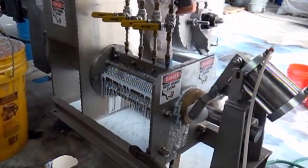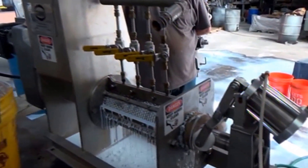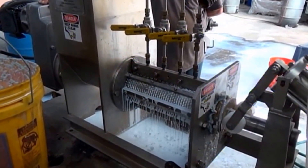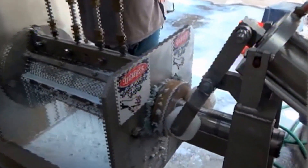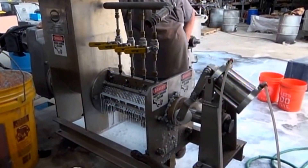After that false start, we're letting it run to empty out the inlet hopper, hoping to pack enough material in here to form a plug and get this started. That's more like it — I was afraid it was going to keep purging. It's a handy trick; it's in our manual: just fill the press halfway up, then stop putting stuff in and leave it run until it empties itself out, and in the process it'll make some dry sludge to get us started. My guess that 20 PSI was way off — we're going to run at a higher pressure.